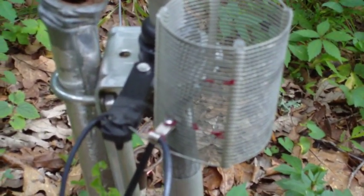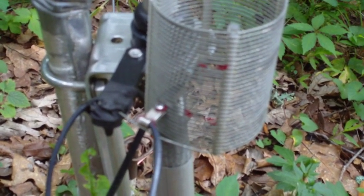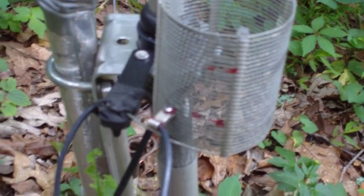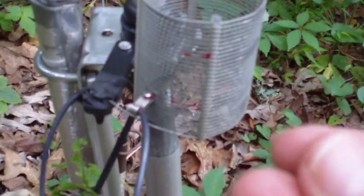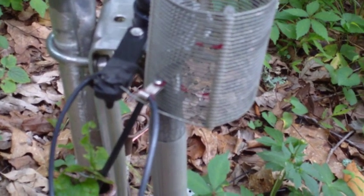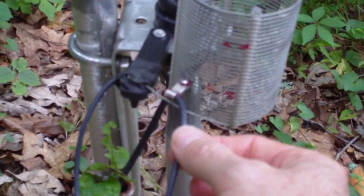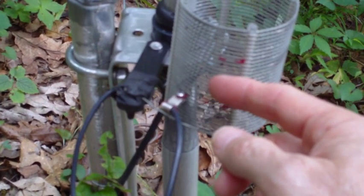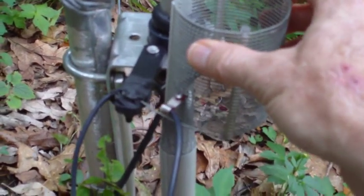This is what I have on the antenna — I will be moving the induction clip. There is an advantage and a disadvantage to this antenna. The advantage is that it's cheap, it doesn't cost too much money. The disadvantage is you have to literally move this induction clamp up and down the induction coil to really allow it to resonate on the frequency that you're transmitting.